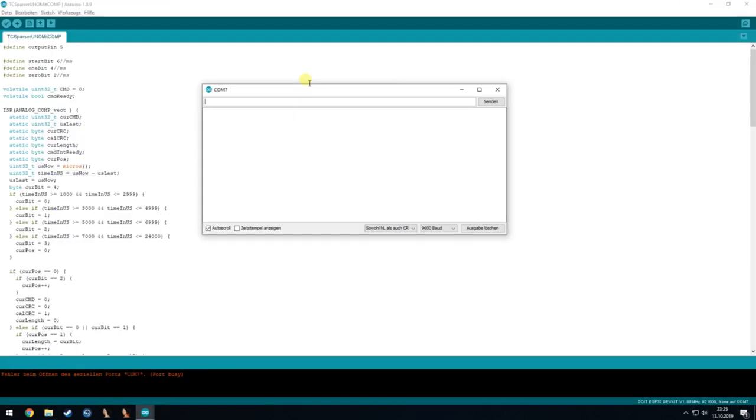Okay, so I also want to show what is happening on the serial port if we just look at it via the raw values. And if I now press some button on the outside station like this, we can see there are 2 messages on the bus. We also saw that earlier on the oscilloscope: we first have the calling command to the serial number, and as it doesn't get answered in the 22 milliseconds range, it resent the command just to make sure it wasn't dead on arrival or something like that.